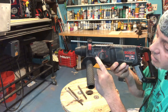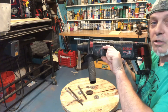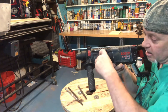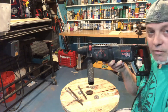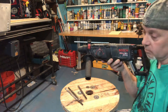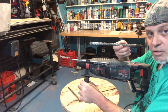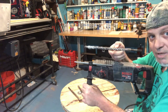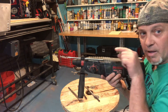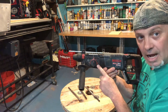This dial has a couple of different settings. The first is drill — for drilling metal or sometimes wood. The middle setting is hammer drill: you push the lever down and turn to where it shows a picture of a drill with a little hammer. That's for concrete. When drilling holes to put anchors in your floor or concrete foundation wall, you put it on hammer drill. The bit is drilling but also hammering — going boom boom boom at the same time — which makes it faster.